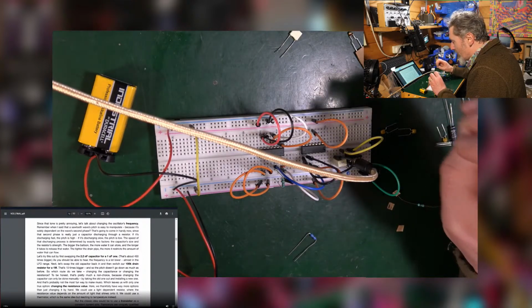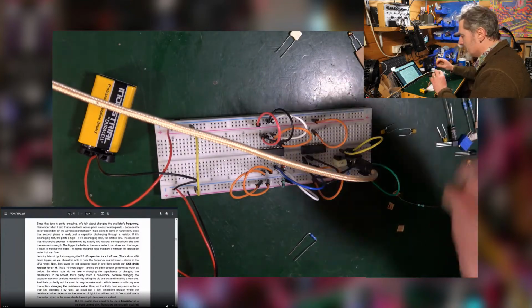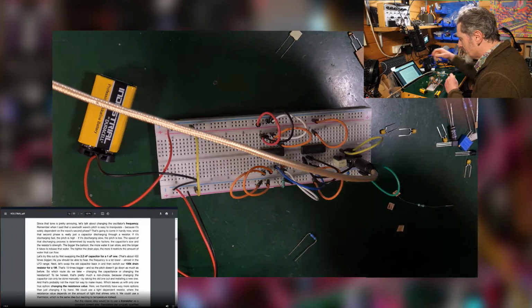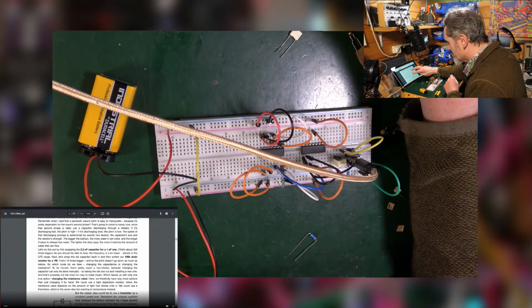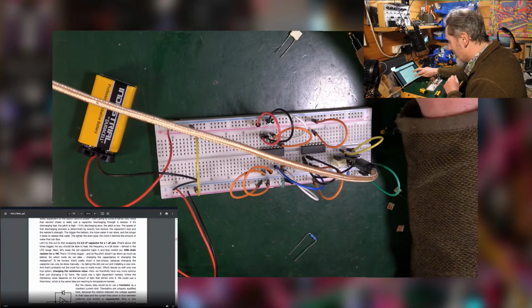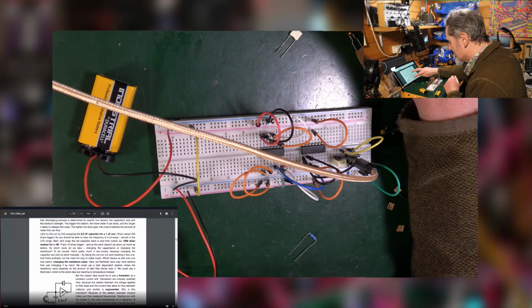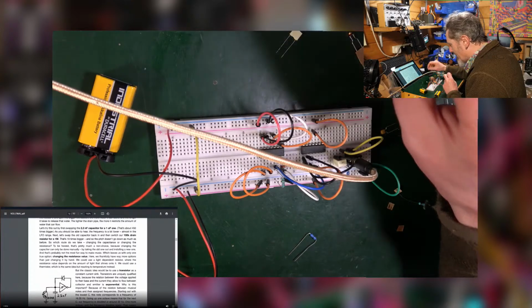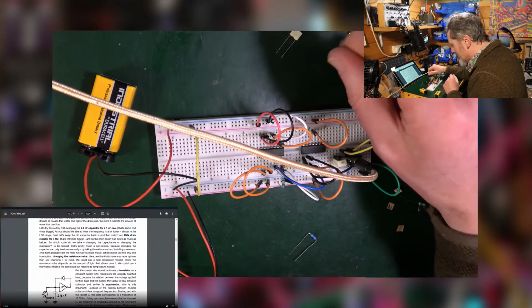We thankfully have more options than just changing it by hand. We could use a light dependent resistor, where the resistance depends on the amount of light that shines on it. We could use a thermistor, which is the same idea, reacting to temperature. The classic idea would be to use a transistor as a constant current sink. Transistors are uniquely qualified here because the relation between the voltage applied to their base and the current they allow to flow between collector and emitter is exponential.